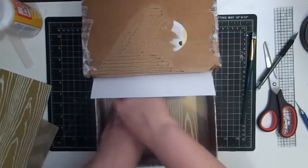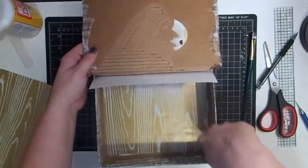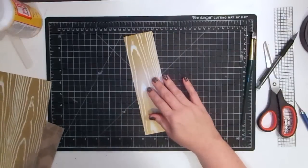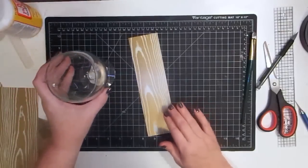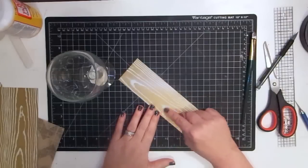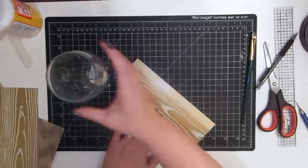This piece is too tall so I'm going to trim it, but not just yet — I'll let it sit for a few minutes and let that glue set up first. Now I want to get these sides ready. You remember how we used our glass to get the curve on the sides of the box? We're going to do the same thing here. This strip is cut just slightly under two and a half inches wide because of that bulk we talked about.